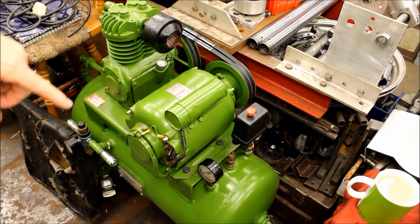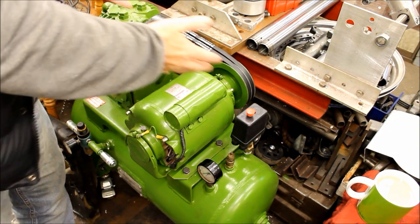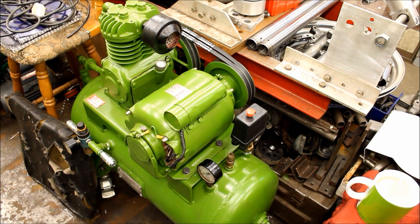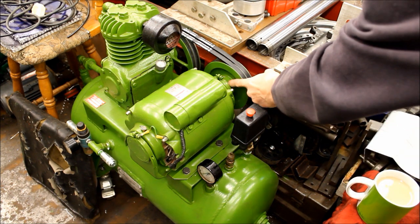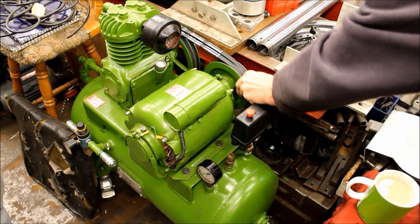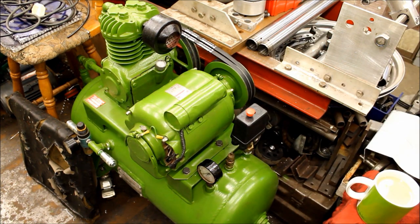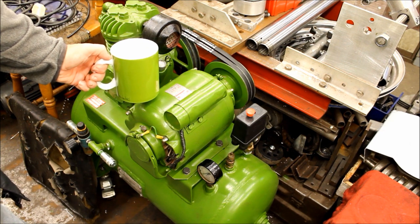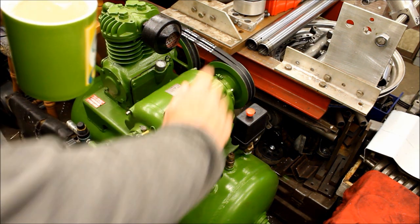Jeff's telling me he's now got his new V-belts to drive his compressor — it's all been rebuilt and that'll soon be ready to go. That's about nine or ten CFM — good for spraying. So maybe we'll be spraying the frame and stuff soon, though it's going to be next year now — do it when the weather's a bit warmer, it's too cold now. That pulley wants a small shim making for the shaft, then it can be fitted on and adjusted — just got to put the cable in and it's all done. It's even colour matched to my mug of tea.